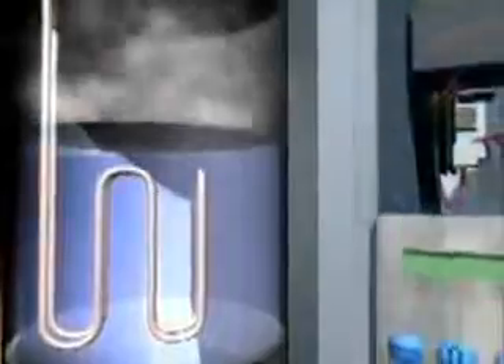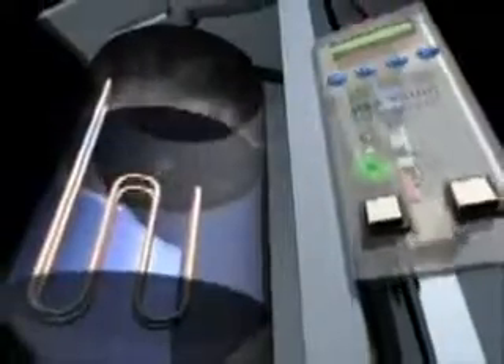The resistance heating principle of the MK5 permits high control accuracy. The fully variable steam output from 0 to 100% is ensured by electronic control. The required volume of steam is produced according to the frequency of the switch pulses and the number of heating elements operated.